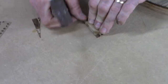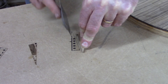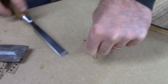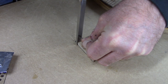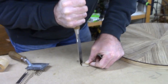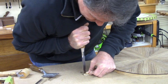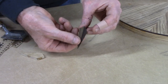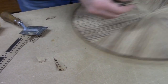I'm going to hold pressure and use my veneer saw to cut these long sides — just careful not to cut yourself. Nice clean cuts down the sides. Now to make that short cut, you don't really have a lot to bear against, so I prefer to use a nice sharp three-quarter inch chisel. I'm going to lay it flat against there, put my shoulder behind it, and chop it right off. This is a good 90-degree corner — that's critical to have these things fit. I would just cut one like that and I need three more, then do the same thing with the little pattern. I'd end up with four large ones and four small ones.